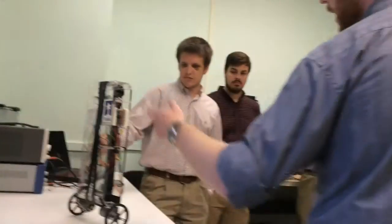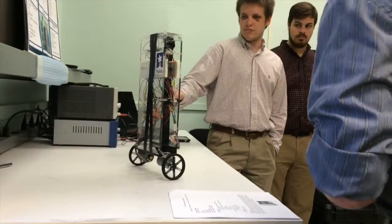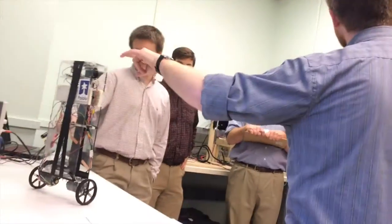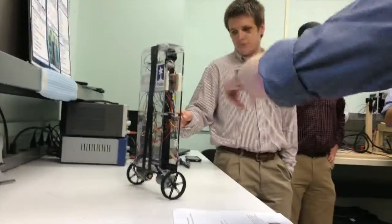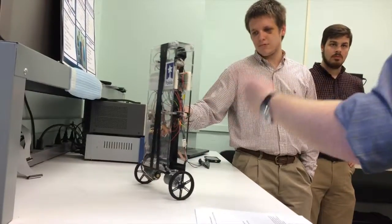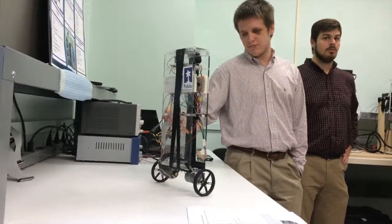And it's being driven by a dual motor driver. So it's one integrated PCB that 12 volts goes into, and then we also feed a PWM from the TIVA, and that controls the apparent voltage to the motors. And so as the robot needs more voltage to the motors to balance, the PWMs change and more voltage is supplied to keep it upright.